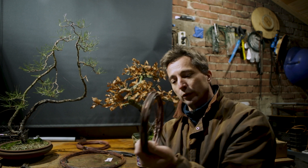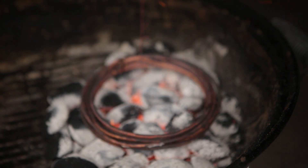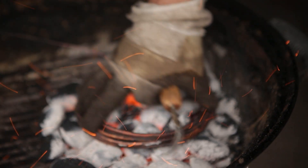Now if you want to do this yourself, keep in mind the longer you keep it on the fire the more the copper starts to oxidize. It is a tight balance — you need to get the whole roll hot enough to anneal, but at the same time you don't want to leave it on so long that it gets brittle, because that is what can happen if you leave it on too long. This roll of wire has been sitting in my shed for too long — I can't actually bend it with my bare hands it has gone that hard. So I'm just going to chuck it on. I'm wearing leather gloves that are soaking wet so I don't burn myself, and I leave the cable hanging out, closing it with just a little bit of an opening for air.